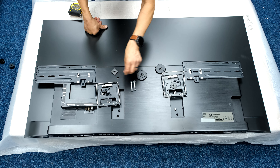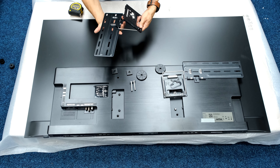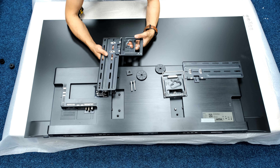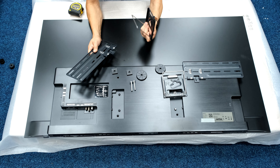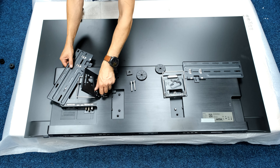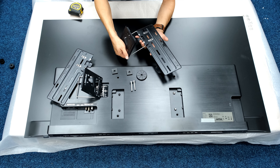The top tip, as I've done before, is to snap these in to the brackets. What I do before mounting — especially when it's a brand new one — is pull it down and click it in so it's fully in, and that should snap back flat. I usually do that a couple of times. The first time it's really stiff, and the first time I did one I'd put it all together, mounted the bits on the wall, then tried to snap it in and put so much pressure on I thought I was going to break the TV. So it's good to just snap it in a couple of times before it's on the wall, each side, so you're not putting all that pressure on the TV.